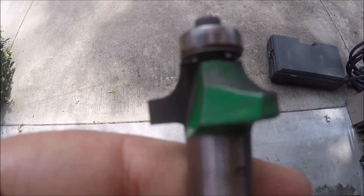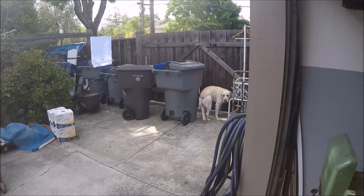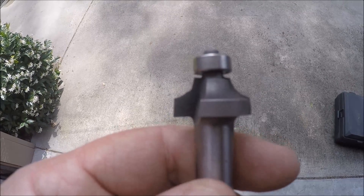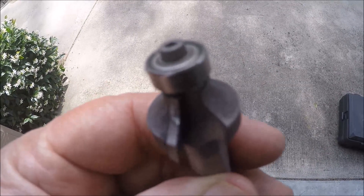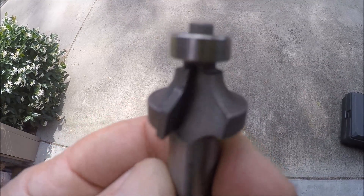You can see the shiny spot there — I don't know if that's focusing on the wear. But like I said, I'm going to switch over to the new bit. There's Howie at our side gate — some people are walking by with their dog and he wants to know who's leaving pee mail on his bushes out there. We'll go check it later, Howie. Now, this is the first router bit I used that I just had in my drawer — it was brand new. And you can see, compared to the Grizzly, it didn't live long. It wasn't happy cutting the steel. But I have to say, the carbide in that Grizzly is really tough stuff. This one didn't live very long at all.